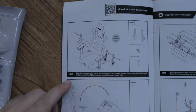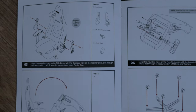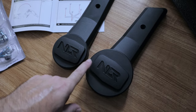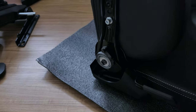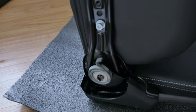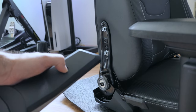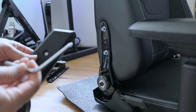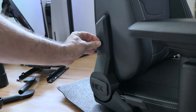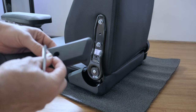For step three, we're going to be putting these covers on on each side. We've got the two covers, 5mm by 10 little bolts, and two plastic covers. The covers are two sizes - one is larger, the other is smaller. The larger one is going to go over this mechanism on the side of the handle, and you guys can kind of see that spring there. Everything looks pretty nicely built and heavy duty. It just goes over just like that. I'll put the little bolt in there, line it up and tighten it in, then grab one of these little caps and cover the hole. Very nice. We'll do the same thing on this side.